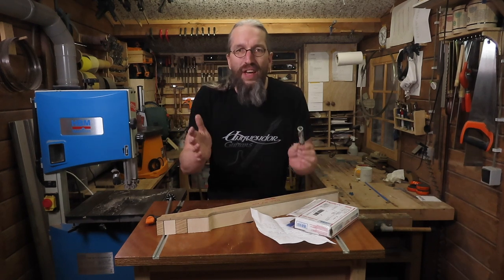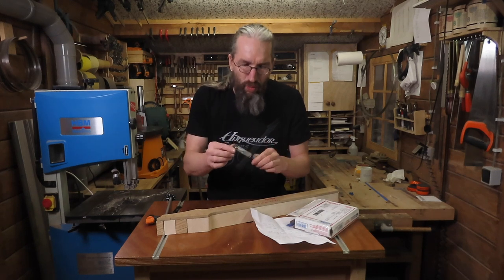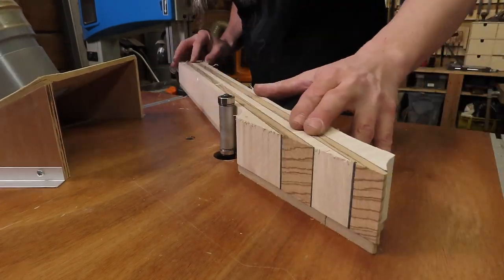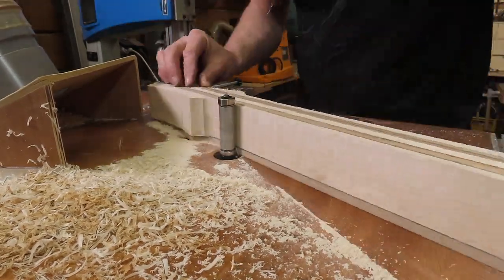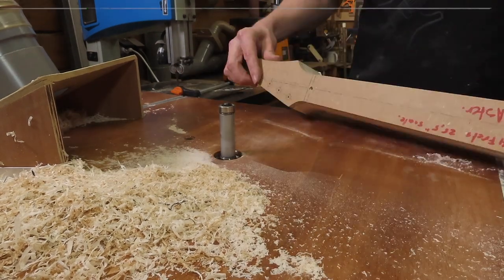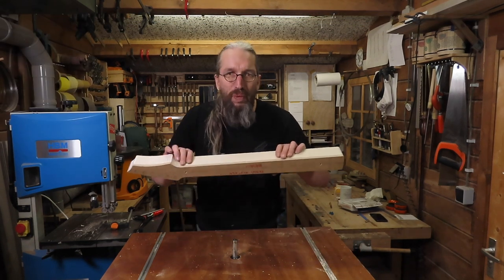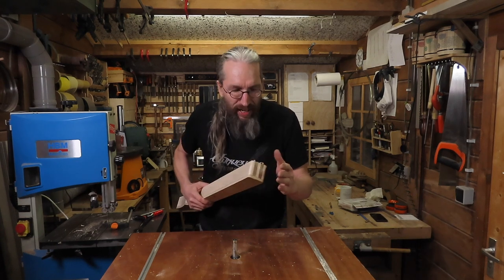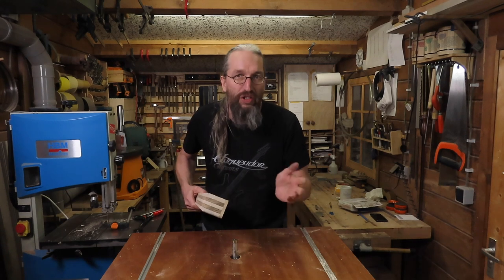Chip, if you're watching, I really appreciate you sending me this little gift and I'm sure I'm going to love it. I haven't tried it before, so I'm going to try it on this neck. It's a very good quality router bit — at least a very smooth finish. It's very convenient; I can now route the entire thickness of the neck blank in one go. I can adjust the position of the guide bearing so I can route with the grain at all times. This is probably the biggest bit my router table can handle, but it all went fine and the end result speaks for itself. When transitioning around this little corner there was a small hiccup, but that's probably because I'm not used to this router bit yet.